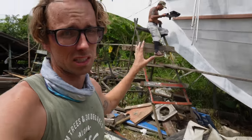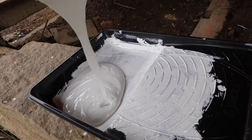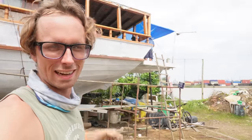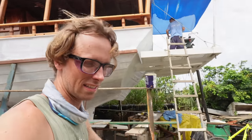The Vinci Derdi is quite patchy, because it's a very thin in-between layer. However, the Vinci Poxy, which is going on right now, is thick, almost a paste, and I have mixed the tub very, very well. It's literally a paste that you're just applying in thin layers. So there's gonna be 2 layers of this Vinci Poxy going on, which is gonna make the boat look completely white without any patchiness. The table saw was making such a mess over there in the pilot house that we've created a little tent behind here. So all the dust goes in the vacuum still, but not in the pilot house.